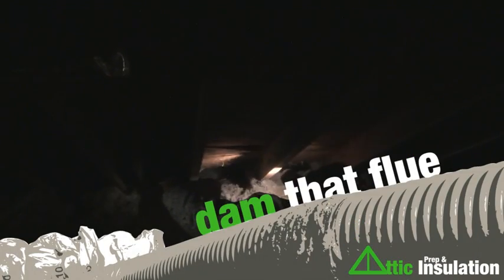We found that the chimney from the fireplace — a wood fireplace — is running on the outside here. So we're just going to cover that hole up so that we don't blow any insulation around that fireplace stack. He's just in there sealing that up.